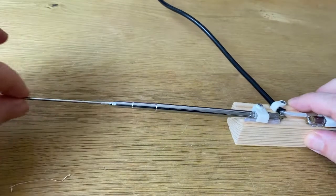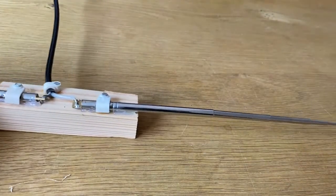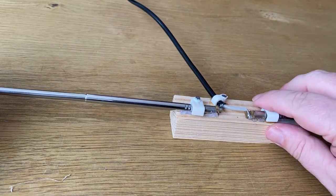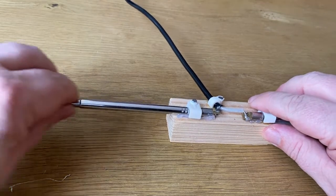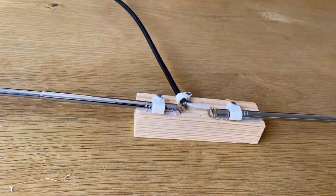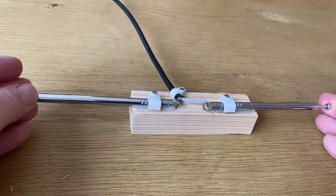Using this little test dipole antenna, you can basically extend or retract each side of the dipole to increase or decrease the length of the antenna. You have to make sure that both sides match because it's a balanced antenna. So it's a handy way of playing around with the antenna length.